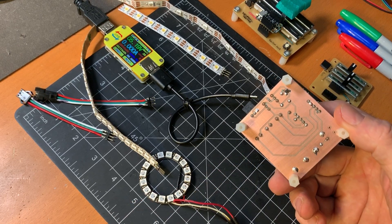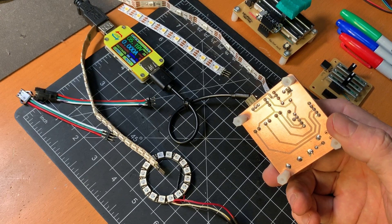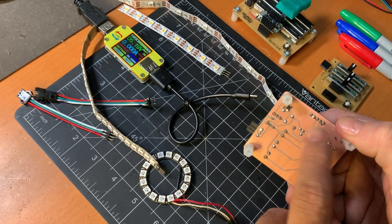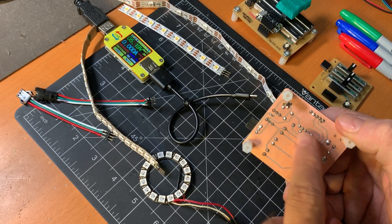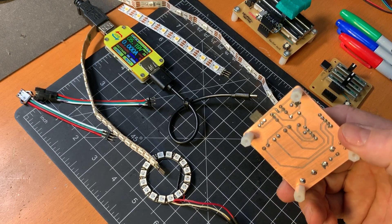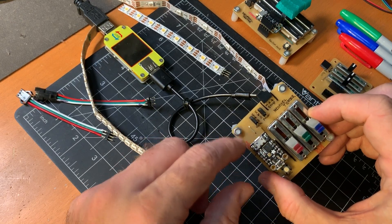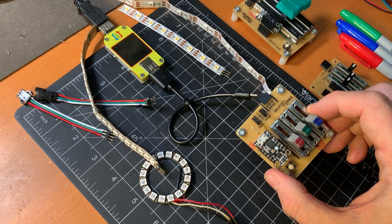This little other-mill-made board works pretty well. These boards are also up on OSHPark and they're much easier to solder. Even if you don't have much surface-mount experience, you can solder this down even though it looks very tiny. But if you don't want to use the level shifter, you can just put it in 3V mode and deal with the fact that some strips won't work very well.